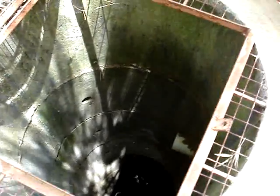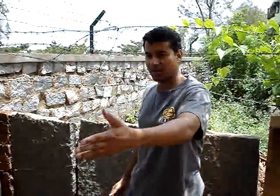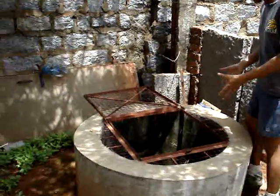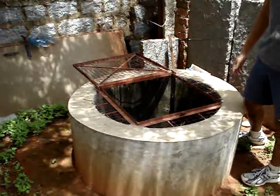The water goes in here. The idea of this well is actually to recharge the groundwater around this area. When we collect the water that comes in from areas of the household apart from the roof, we send it down into this well, which then allows it to slowly seep into the groundwater system, reducing runoff and loss that way.